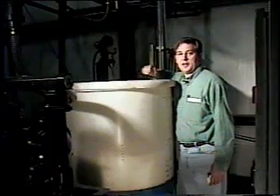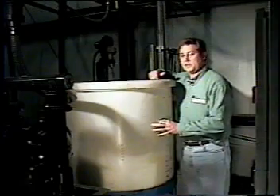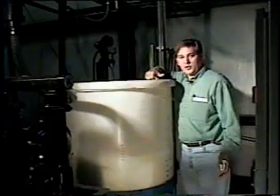This is a chemical make-up tank for the process system. Joel mixes up his polymer and water ratios in this tank, blends it, and then a peristaltic pump doses it into the reaction tank during the process cycles.